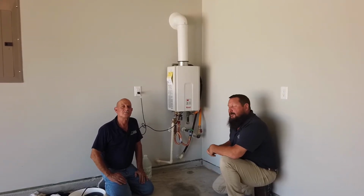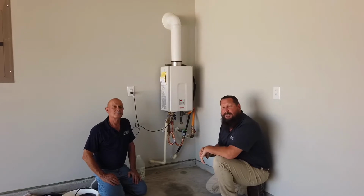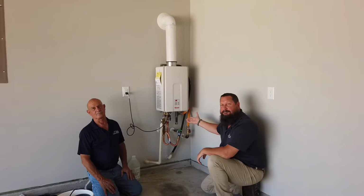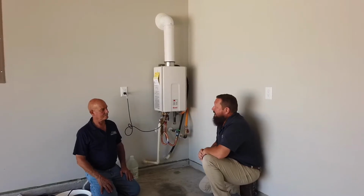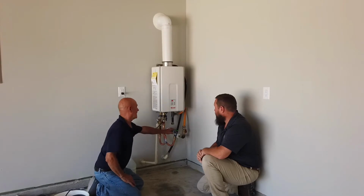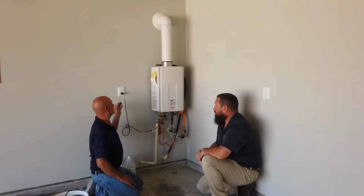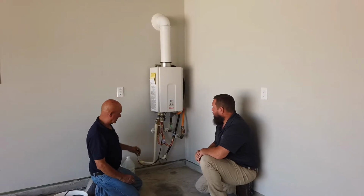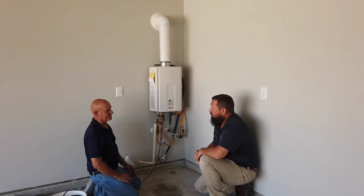We're here today with Bill with Chaparral Plumbing to talk about tankless water heaters and how to flush them. Bill, what's the first step we have to take? First step we would have to take would be to turn the water off. Turn the unit off and unplug it so it won't accidentally turn itself on.